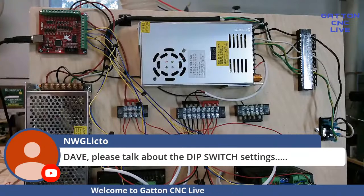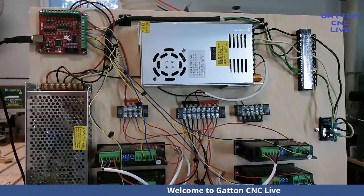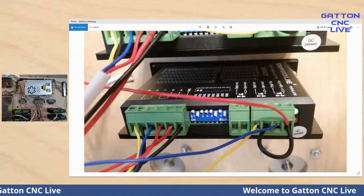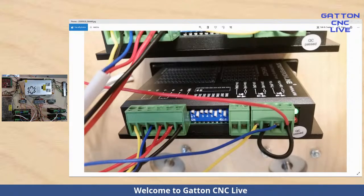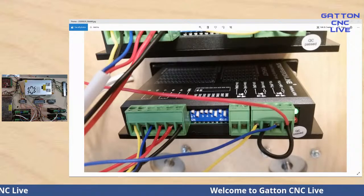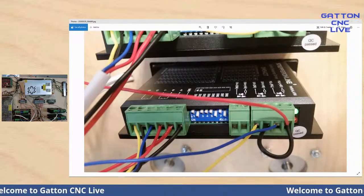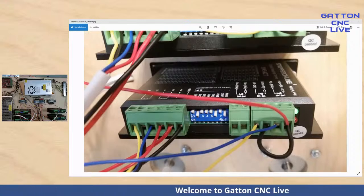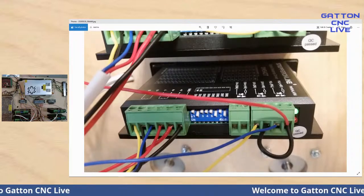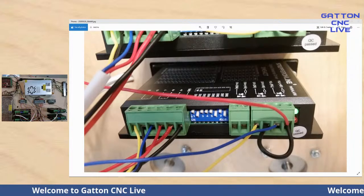And what I'm going to do is take not only these close-up pictures I have, but I'm going to shoot little video clips showing this is what your stepper motor does if one of your direction wires is off. Or this is what your stepper motor does if you've got your A and B coil wires mixed up. Then I can show you how they're miswired, and you'll be able to see the jumping around and the different things that the stepper motor does and the noise it makes. It usually doesn't make a real nice noise when it's doing that.